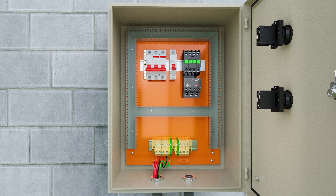Now let's connect the power circuit, connecting the three phase wires to the three-pole MCB miniature circuit breaker, and connecting the grounding wire to the ground bus. We take a phase A wire from the input of the three-pole MCB and connect it to the one-pole MCB.